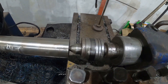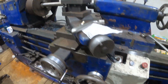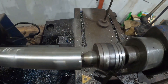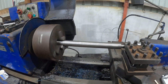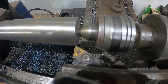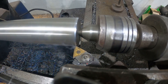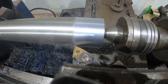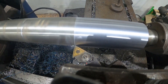That center is on bearings so it'll turn nice and freely. We've set the lathe going at 250 RPM and we're just going to fetch this diameter down to the right size so that we can thread it. This piece will then thread into that big red nut that we saw at the start. Here it is now just shaving it all off - a really really nice clean finish.